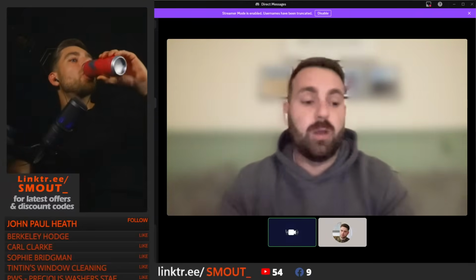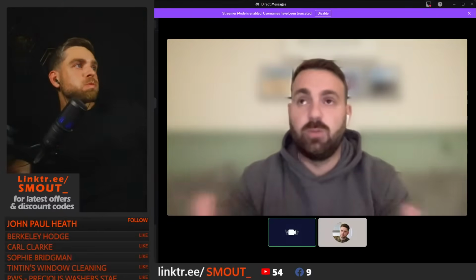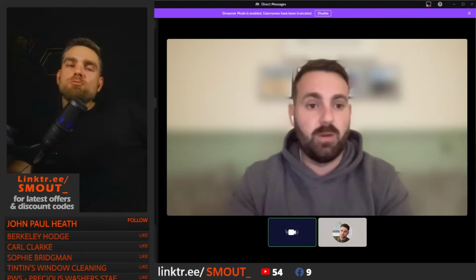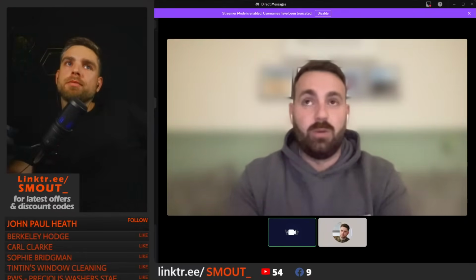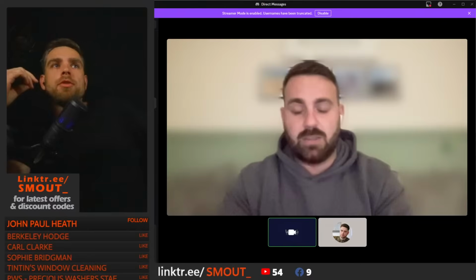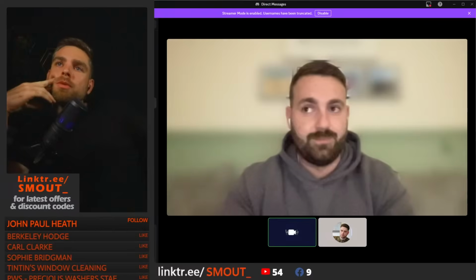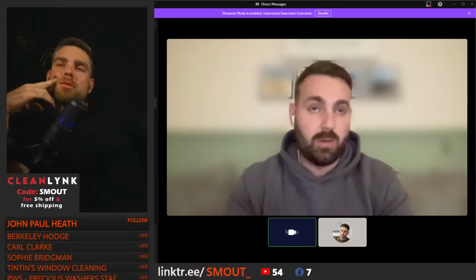So let's say you've got a 21 litre per minute machine. For that to work, you then need to split your nozzles down to 10.5 litres per minute going per nozzle, and I've had an 11 litre a minute turbo nozzle. It's not very powerful. What's that, like an 02 or an 03 maybe? I don't know the actual thing, but it's my first machine. Took ages because obviously it didn't have the power, because it's only 11 litres per minute going through the turbo.